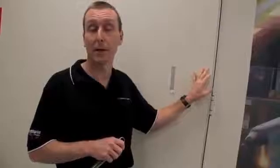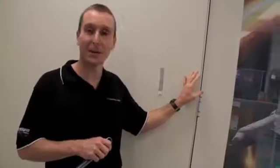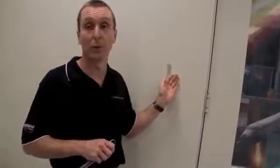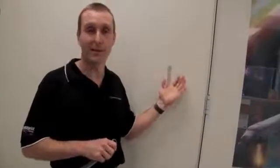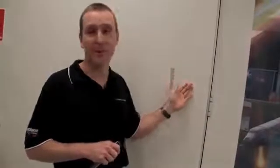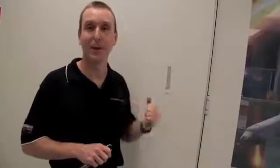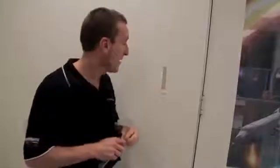As I mentioned earlier, also make sure that you choose somewhere where if you do pull a little bit of paint off, that's not going to be a problem, and make sure you ask the customer's permission before you do this, and let them know that one of the possible outcomes is that paint could be removed from the wall. What that tells us is, if paint does come away, that probably the surface preparation on the painting wasn't all that great. But we need to know that in advance. Best off to know it beforehand, rather than when you go to remove the graphics after 12 months or so, or whenever, that you strip all the paint off the customer's wall.